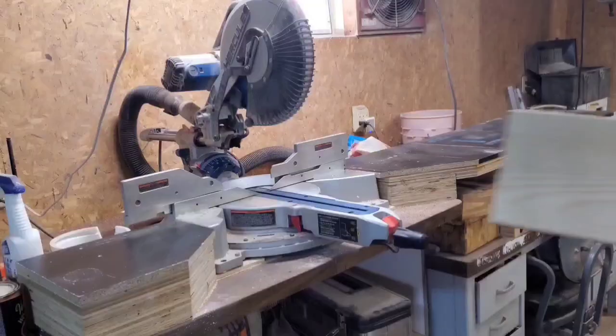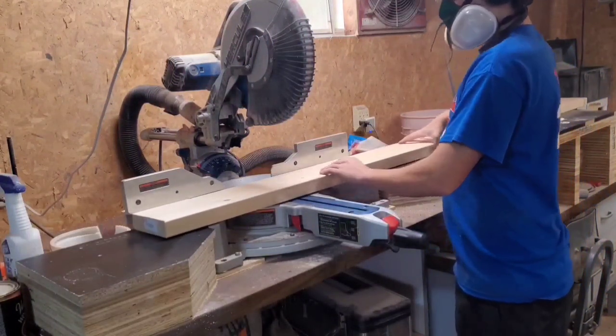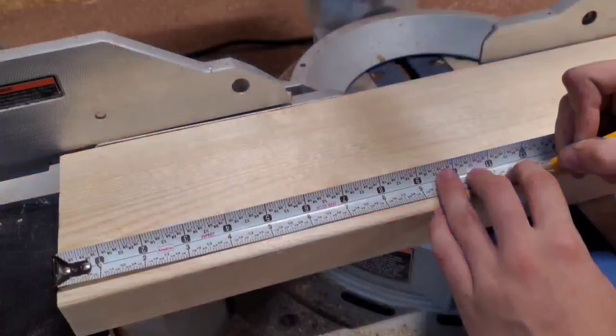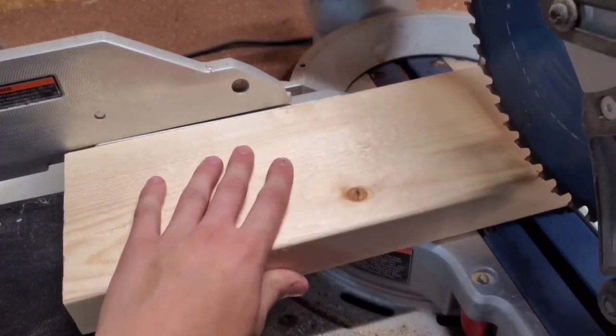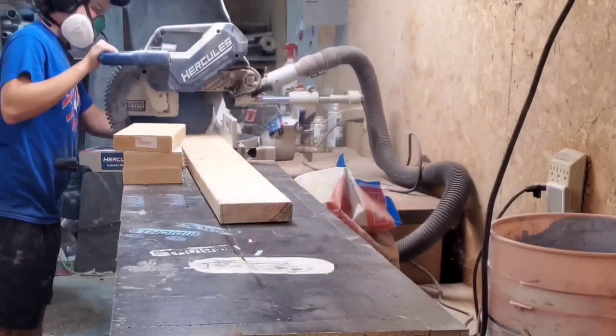So to make these boxes, I'm gonna start with an 8 foot 2x6, just cause I always have a lot of those on hand. And I figured I could make about 10 of those vintage crates with this. To start, I'm gonna cut it into 8, 11 and 7/8 inch sections. That kinda sounds like a weird dimension for this, but that's just the length of the Kraft box. It just had really weird dimensions.